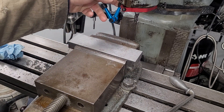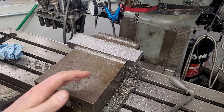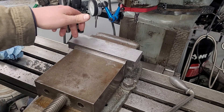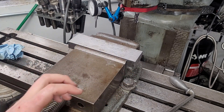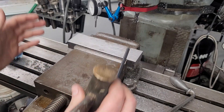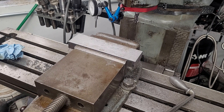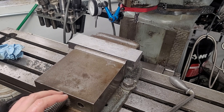If you're ever having parts come out of square, this is where you should start looking. For precision work I'll run an indicator over the bottom of the vise moving the table, because if the two mounting nuts aren't equally tight when tramming it can cause issues. I'll actually have two indicators going while tightening — one to make sure the fixed jaw isn't moving and the vise isn't out of square in that direction, and another on the floor of the vise to make sure it's squared the other way. It's not always strictly necessary, but it doesn't work reliably on this vise since the T-nuts are pretty worn.